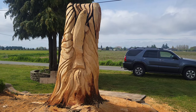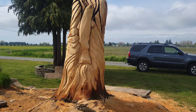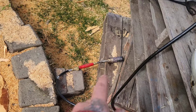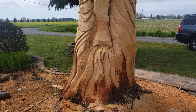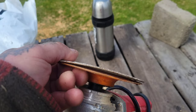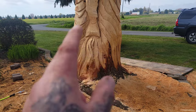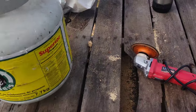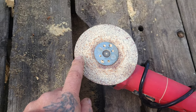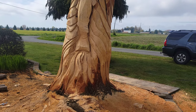Okay, so here I am once again today - lots of sanding. What I'm gonna do before I do this sanding, I got my little tiger torch here. I'm gonna keep the wood warming up a bit. I got this 36 or 40 grit sanding disc on here. I'm gonna heat the wood up because if you use these on wet wood it gums it up.